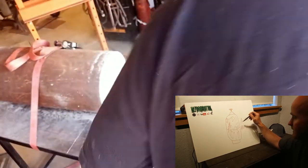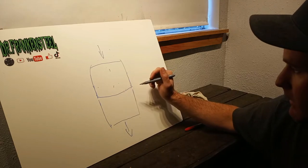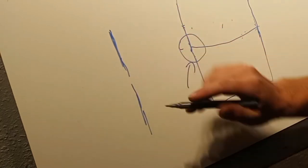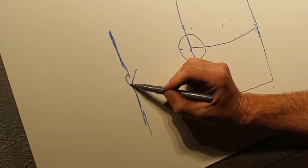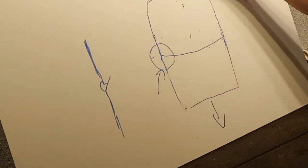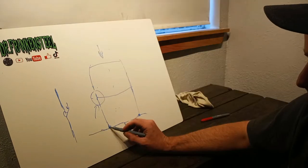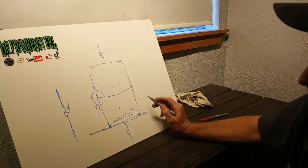The porous material and the acetone stabilize the acetylene. This tank is actually two halves. Doing a close-up on the weld joint — here's the wall of the acetylene tank and here's the weld joint. How the two halves fit together is one lip is underneath and one lip is over, then there's a weld put on the outside. So there is that much sticking on the inside of the tank. I'm going to test putting this in my press and applying downward pressure.